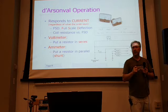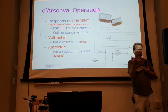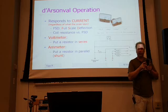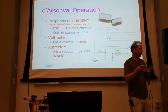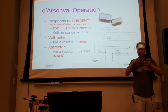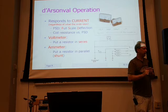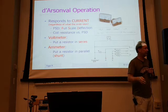So when you go down to lower scales, like a 1 volt scale, then if it's a 20,000 ohm per volt meter, it looks like a 20 k ohm resistor. But at a 10 volt scale, it looks like a 200 k ohm resistor. At a 100 volt scale, it looks like a 2 meg ohm resistor. The resistance of the meter, when you put it on your circuit, is going to depend on where that scale is. The digital multimeters are typically all 10 megohms, and that's it, it's fixed.